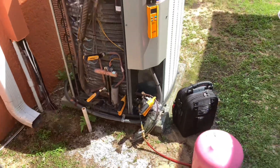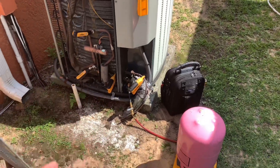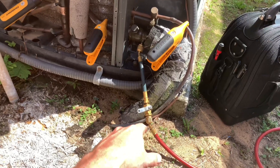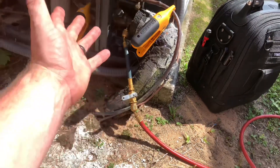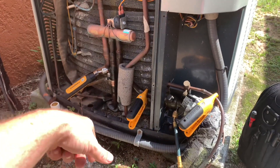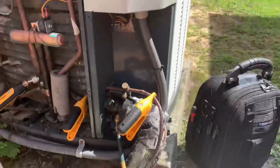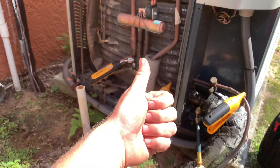This is just a quick little video on how I use probes to charge. There are other ways — I'll do another video on how I do it on a different system. Basically, all I do is take my schrader core tool, separate it, put it right there, put my probe on the core tool, and then I can isolate it. That way I can check my reading across my low side to make sure it's accurate while I'm charging and not just blasting refrigerant.